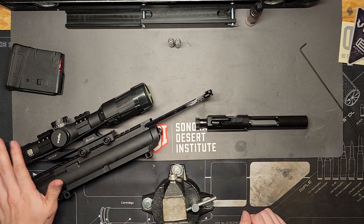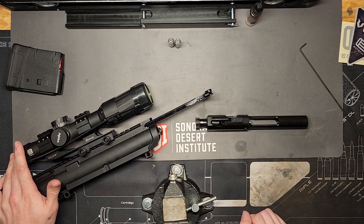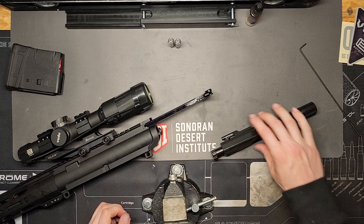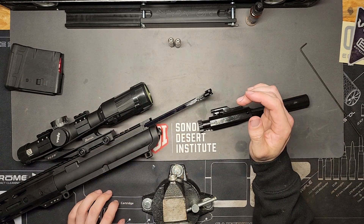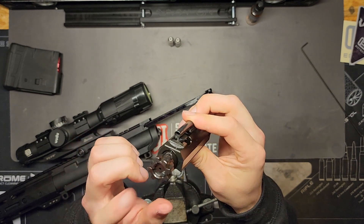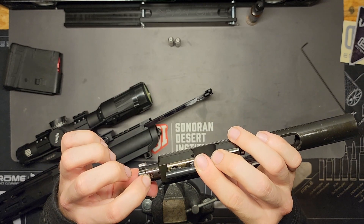Moving on to the firearm side of things — the barrel. The barrel also consists of the barrel extension, and you're going to have your chamber, your throat, the locking lugs, and everything. That's where things start to get tedious. When you get to the locking step of the cycle of operations, those are the lugs that are going to lock into the lugs on the barrel extension. I don't know the exact numerical specification for those lugs in relation to the chamber or the locking lugs on the bolt or barrel side, but I know it's pretty close. An issue you can see with heavily used or poorly made bolts is a poor shot-peening job, or the bolt not being Carpenter 158 steel or MPI — magnetic particle inspected.